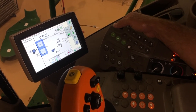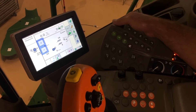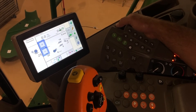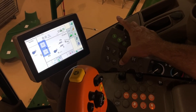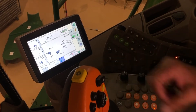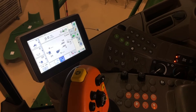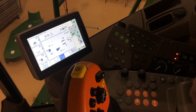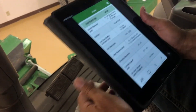A recommendation and an easy way to get started: if you have a harvested cob and a metric wrench, slide that wrench over the cob and whatever metric wrench fits that cob is a very good starting spot. Last but not least, we can set our fan — hit the fan button, separator engaged, running at full speed, and we can probably start fan speed at around 1200. The only way to truly get this machine set correctly is find a spot to start, start harvesting, get the machine full, check the grain tank sample, get out and check your ground, then make adjustments accordingly.